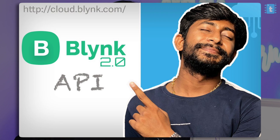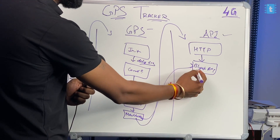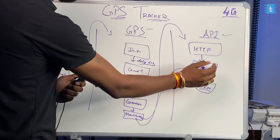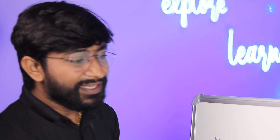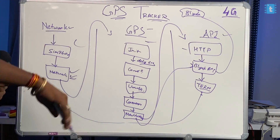If you want to learn more about Blynk APIs and how to send and receive data using them, I recommend one of my previous videos dedicated to Blynk APIs — the link is in the description and the i-button. After embedding the latitude and longitude coordinates in the Blynk API, we terminate the HTTP protocol using HTTP term. This sends our data directly to the Blynk cloud without using any Blynk library, and then this whole loop repeats: checking network, checking GPS, sending data.